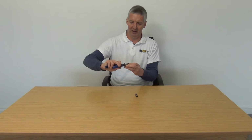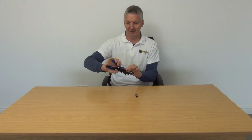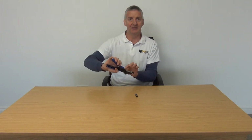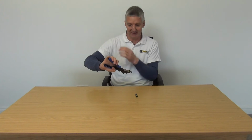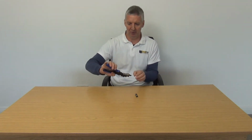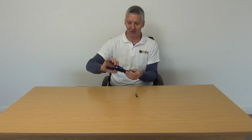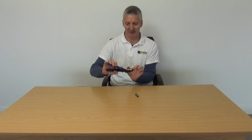And we're there. At this point we can see the base of the connector here is being cut, and the center here is just holding the core wire. So let's push this connector forward, pushing the center forward. I'm not going to squeeze it all the way, but if I squeezed it all the way, the housing compresses.